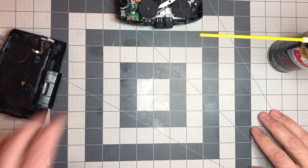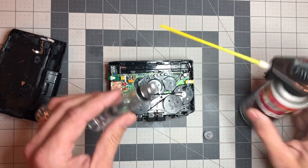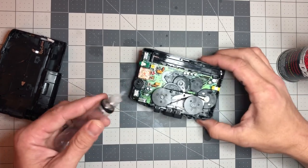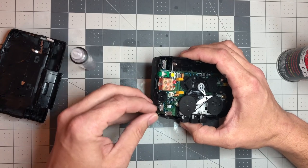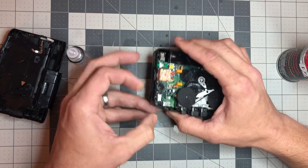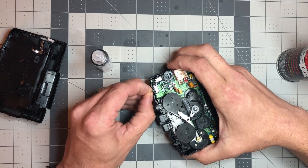I'm going to pull this down. Rather than spray my deoxid directly and get it everywhere, I use a little dropper bottle for better control. I'll look for a little crack in the switch, put a little drop right on it, then work the switch — go back and forth about ten to fifteen times. You're going to work it more after you get it back together too. Just a little dab, get it into the switch, and work it back and forth like that.